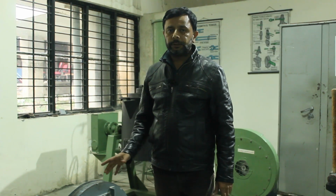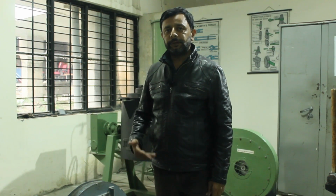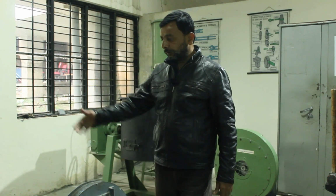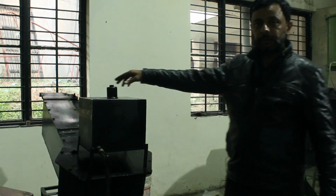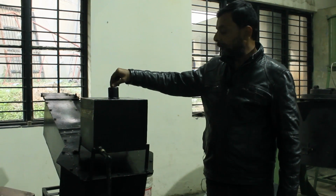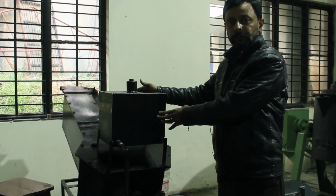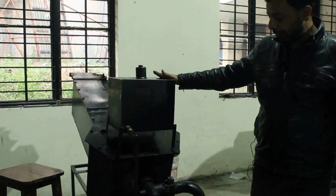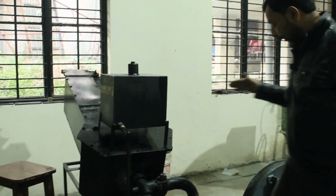In blacksmithy, we are changing the shape of the workpiece by heat treatment. It means we are heating the workpiece, then changing its shape by using different tools. So this is our furnace, an oil fired furnace, in which we are pouring diesel from here. You will see in the practical which is being prepared after this, the demo practical. This is the tank for storing the diesel. Here we are pouring the diesel, then we put a flame inside this and start, then it is working. We heat the workpiece